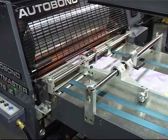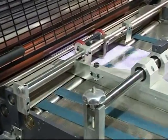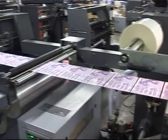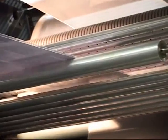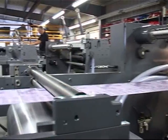Encapsulation takes place when the air is expelled between the pressure rollers when the coated film meets the printed sheets. The sheets become a web joined together by the film. After lamination, the web is air-cooled whilst under tension from precision-controlled pull rollers.